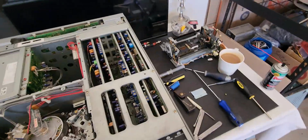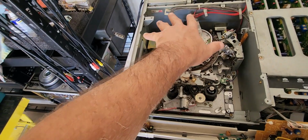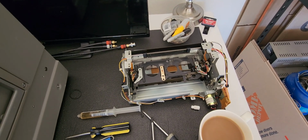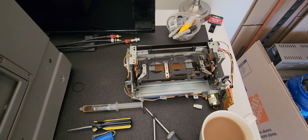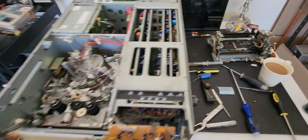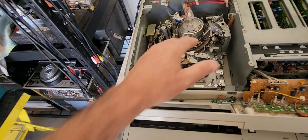They were forcing tapes in the carriage because the loading mechanism wouldn't drag the tape through the deck. This is why they screwed up this loading carriage. Happens every time. Every time I get one of these. Every frickin' time. Because people force tapes into these decks and they end up wrecking the carriage. And normally it's not the carriage at all. It's always the mechanism that does the continuation after the carriage to get the deck to load.